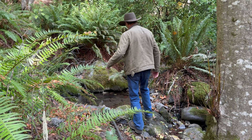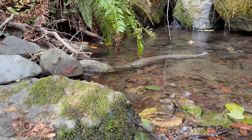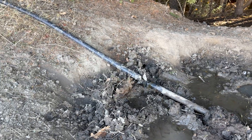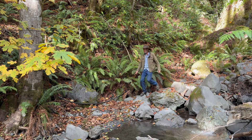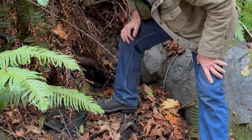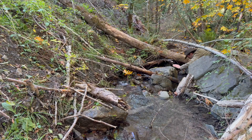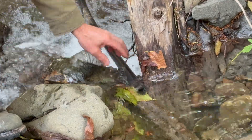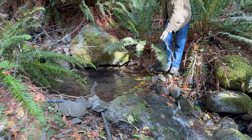We're back at the source in the little creek. I was hoping when I turned on the water down below, there'd be enough water in the line going downhill to create a siphon to get the water to go up over this hump. It could be that leaks in the pipe are preventing it from siphoning. We'll go downstream a bit — there's a sag in the pipe and a joint right here — no flow, just draining what's settled at the bottom. We'll go back to where we took the pipe out of the big creek and put it back in to get some water flowing. I can feel a little bit of suction at the end, so I think it's going. Now back in the small creek, we've got this one flowing again.